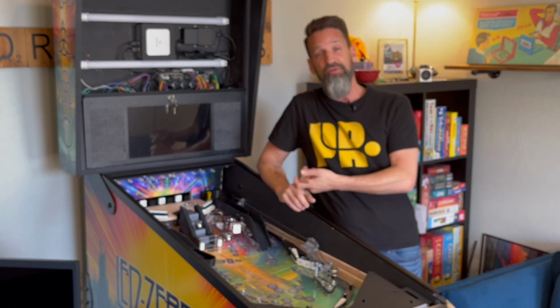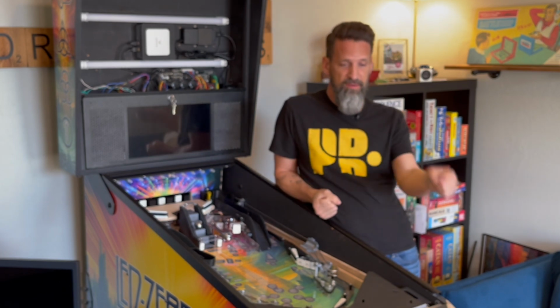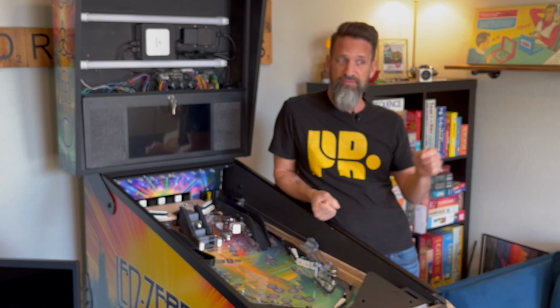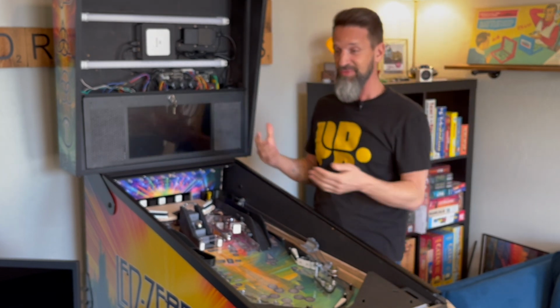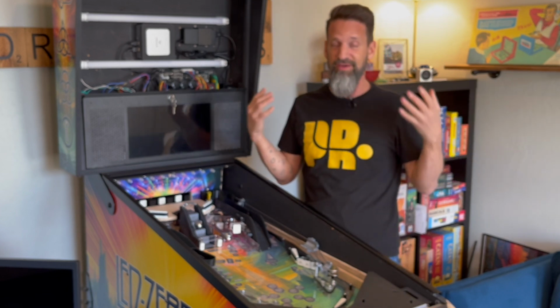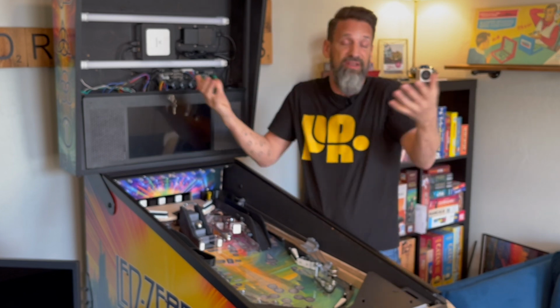Anyways, so I had to start thinking about, okay, how do I handle this? Do I make it so every time you lock a ball, it automatically advances the staircase for you and tries to do a home sequence? Well, that's where Anthony came in, because there was no ability to tell the stepper motor, hey, move until your home switch is active again. That didn't exist in MPF.